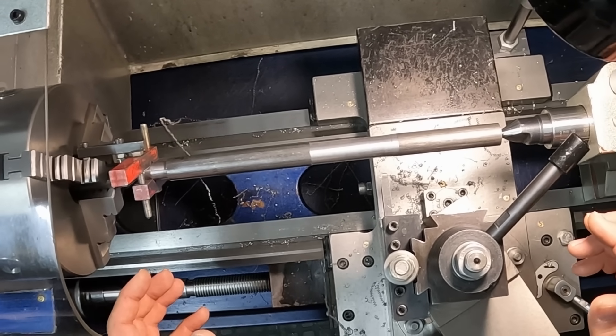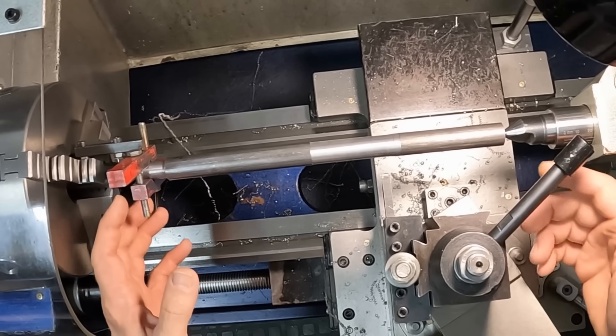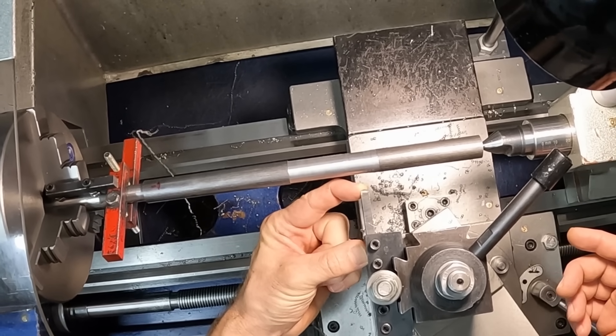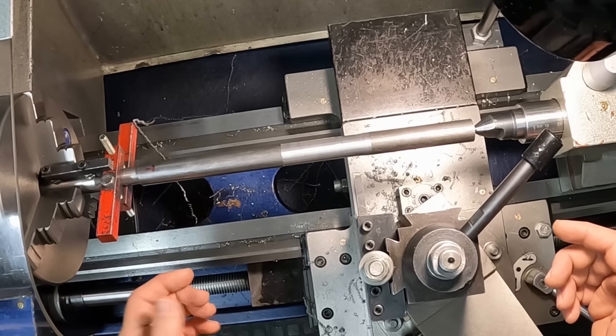This is probably the worst condition you can have on a lathe. It is between centers. It is a dog clamp that is loose. I have a tool with massive overhang, and I am bound to get pretty decent tool chatter.